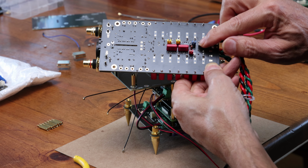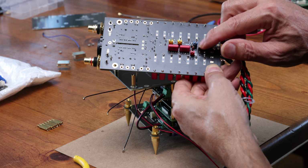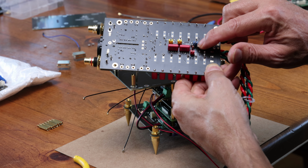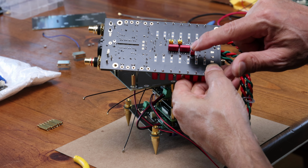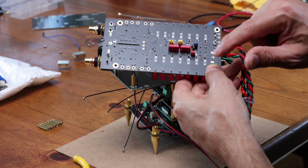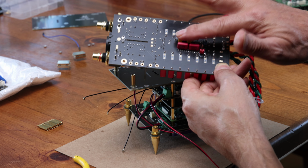And then we're going to make sure that the OB mode is on the +5. So OB plus, that's where the other jumper is. And you're going to connect J24 as well. So you're going to put a jumper on J24 in this traditional mode. And so this is the traditional mode, but we have the clock.